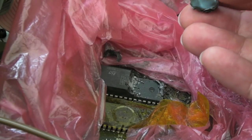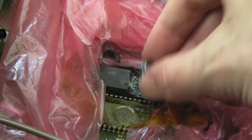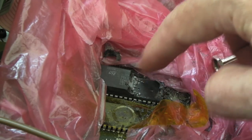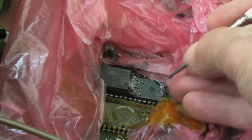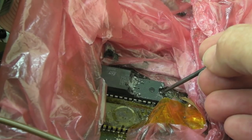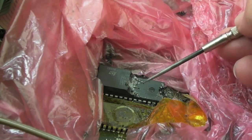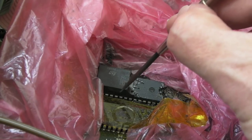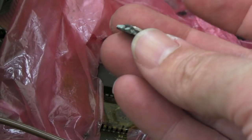There we go — there's no going back from that. As I lifted it up it bent — I bent it up slightly like that and then just cut it off. I can't see the connections, so I just need to carefully clean around that now, just really gently to see if we can expose — there we go. We can see something there — you see the two connections here. I think we might be okay. It's just whether it's still joined up. As far as you can see, just a normal DIP chip under there. I said the top two thirds of the package is there, and that's a plastic filler. But the main thing is that nasty beast is out now.